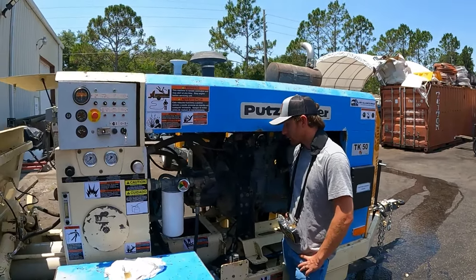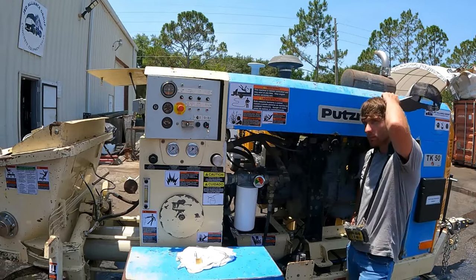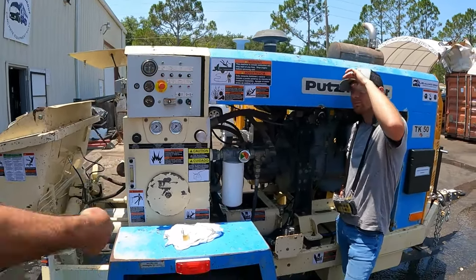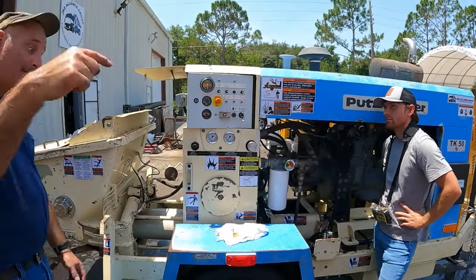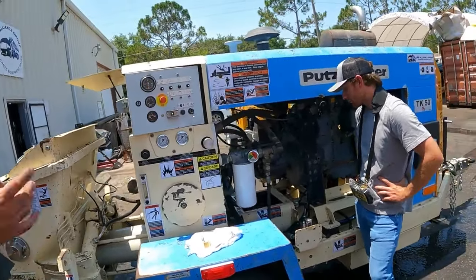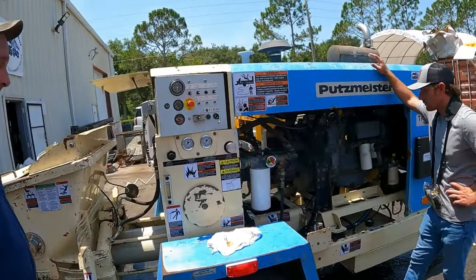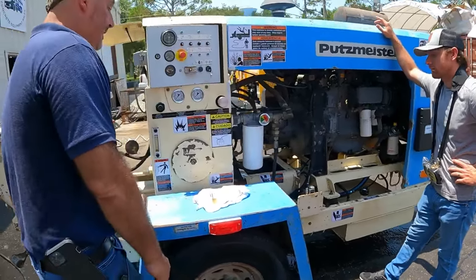The guesswork for you. Now, if you get on a Putzmeister, an 88 design, yes, you have to do it manually. So I would hold this test button every morning and run that thing all the way down until it stopped, and then hit it again and let it pump it again. And then if I did 600 yards, I'm gonna have to come down halfway and then recenter them again. That was a downfall. Because it's trying to add oil, always add oil, always add oil. Taking away is a lot more cumbersome, a lot more process. So when you pressure it out, it's taking away oil, pushing it back to the tank on the return.